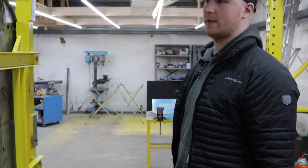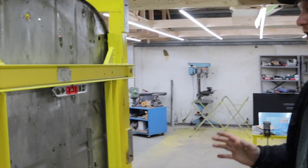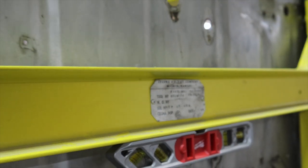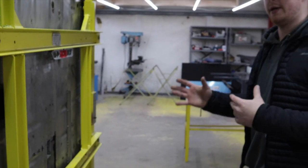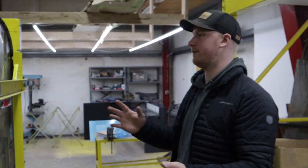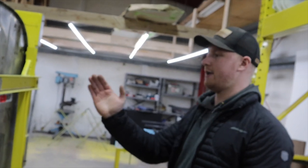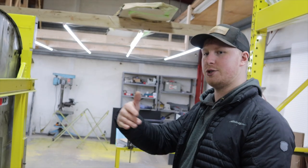How are you going to straighten it out? It's all coming apart anyway. We were just trying to calibrate where this airplane is right now — this is a factory jig. We're purely calibrating where this airplane is now and what we're starting with. It's like a control: how fast was it going before? Now we have all this data from its previous life. With this bigger than design engine, a 555, you're going to probably rig in some rudder input to kick the tail back over where it should be, and then you'll have to counteract that with a roll input.